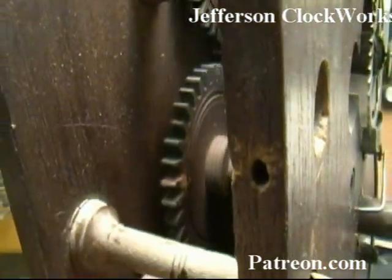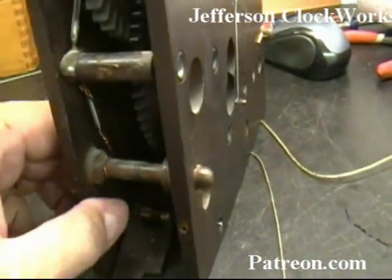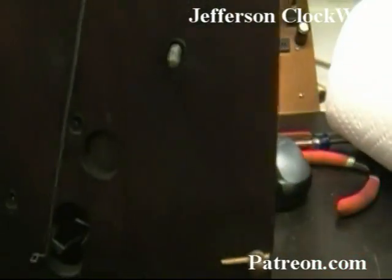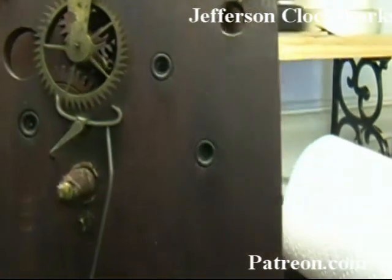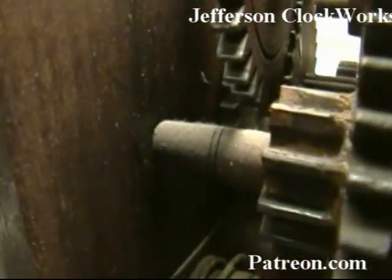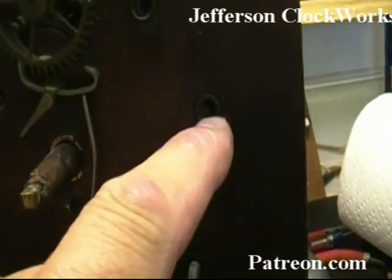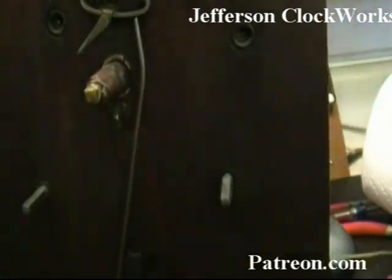There's another tooth that was replaced right there. It's not a very difficult mechanical movement. It has a brass escape wheel on it, and it looks to be a recoil escapement. The bushings that are in there don't look like they were pressed in or anything. I think what they did is they simply drilled out — or used a certain type of drill that hollowed out the plate — and put that little ring around it, even though there's no extra piece that was put inside there.